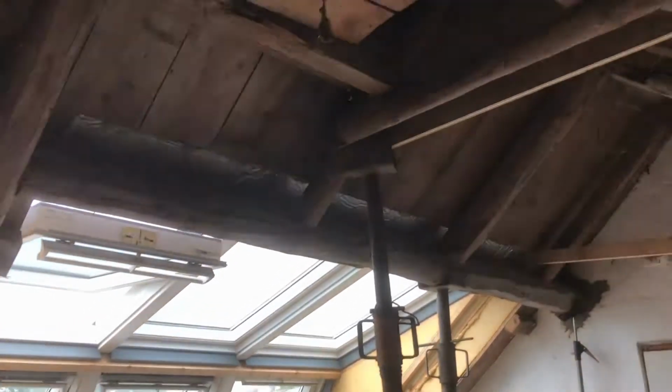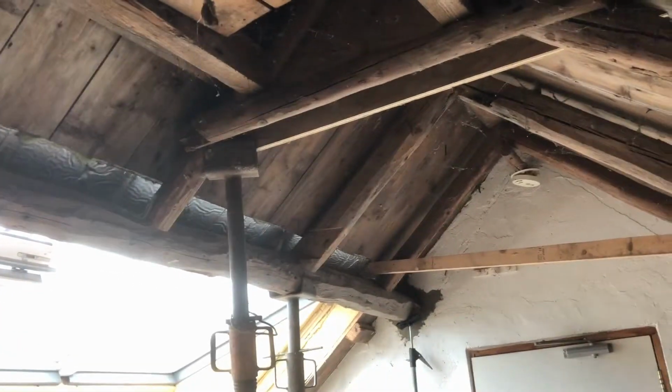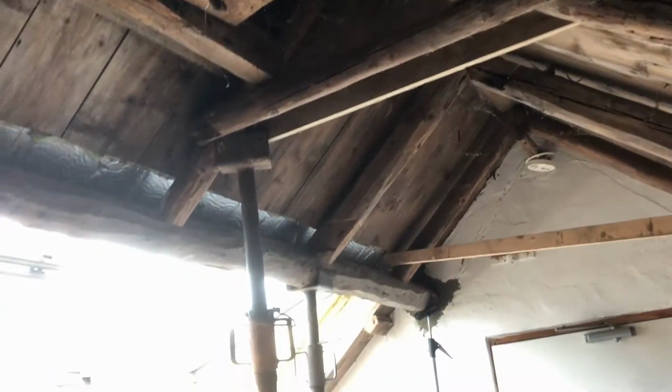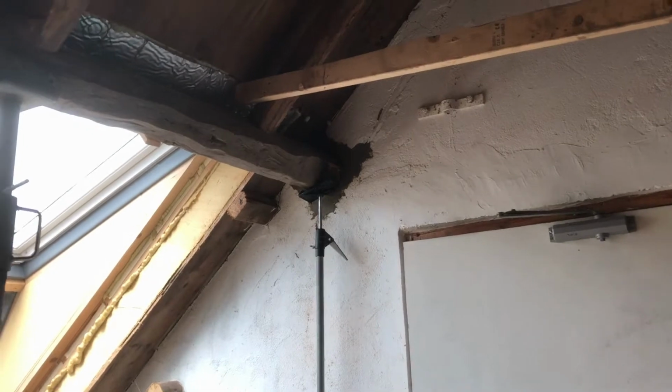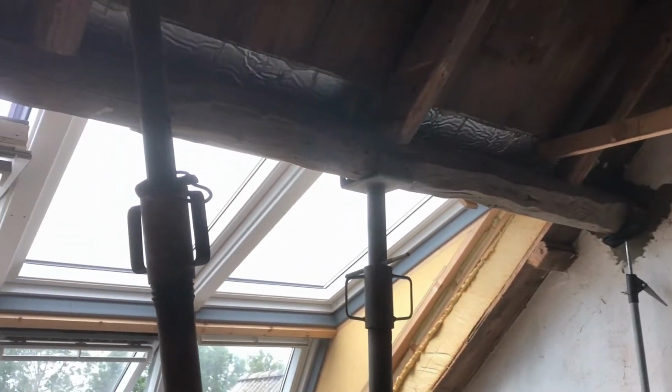Okay, so Kevin and I put that beam in there, and then all the support is caught by that beam at the bottom. Super happy with that, of course. We put a hole in the wall, as I said earlier, and then we put the cement in there, and then we leave the support on for tomorrow, and maybe the day after. Then this support can be gone, and that support can be gone. It's taken off. So that's it for today.